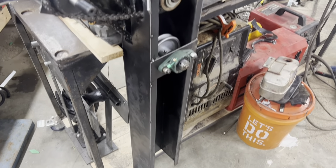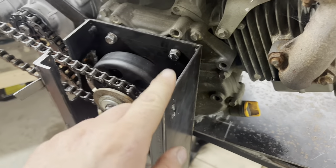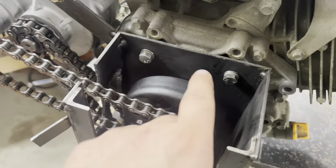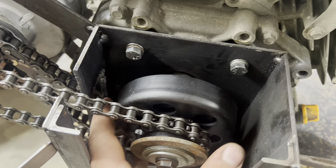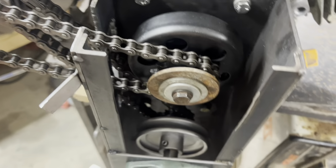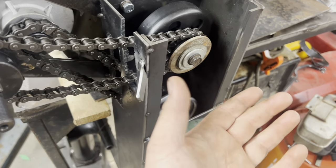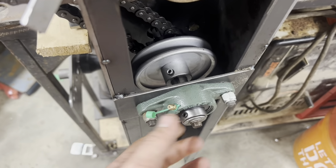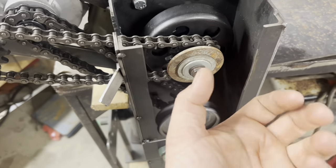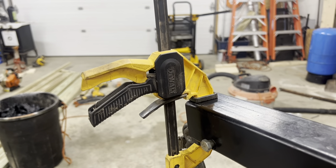We'll start with the actual housing itself, as you can see. This is a 4-inch 3/16th plate on both sides, and this is a piece of 6-inch. I had to do the 6-inch to clear the clutch - I had more than enough space on each side, but I wanted enough room to get my fingers in and around and mess with stuff if I had to. I had to actually spread this apart to mount this piece of steel in here for the bearing, so I just had two pieces of metal tacked on each side with a clamp reversed so I could spread the box part.